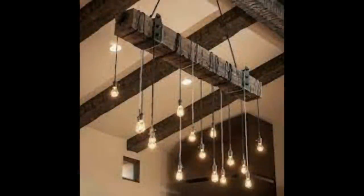Now, the reason it's all the control they need is because of the situation they're in. A light bulb is hanging in the ceiling in the fresh air, and a kettle is bathed in water. When those amps come in, rubbing against the resistance, they create heat, at the rate at which they come in and how they rub. If it's a light bulb hanging in the air, of course, it gives that heat back out almost immediately, so the heat can't build up. It's given out, and that's fine as long as it's in that situation.